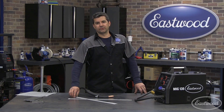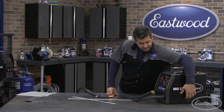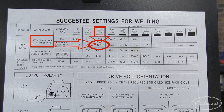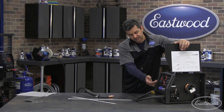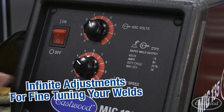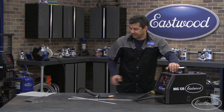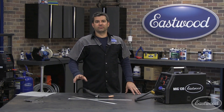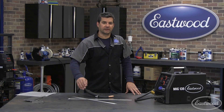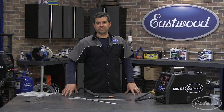What we're going to be doing now is welding on some sheet metal — we've got some 20 gauge here. Machine setup is very easy. Inside the door here we have your chart. Come across the top to your material and you'll see 20 gauge. The setting is voltage on E, wire speed on 4. I like running a little bit hotter on sheet metal, so I'll take it up another notch on the voltage. We're going to use three types of welds on sheet metal: a spot, stitch weld, and plug weld. That'll take care of quarters, floors, and whatever you're running into on the thin metals.